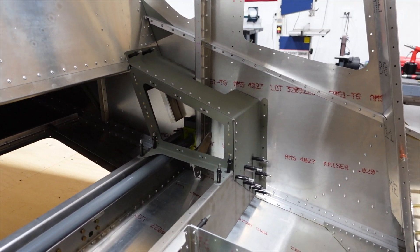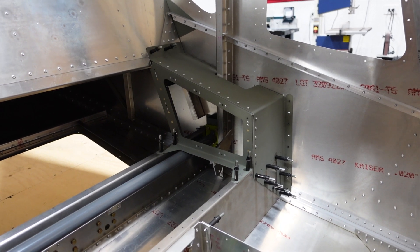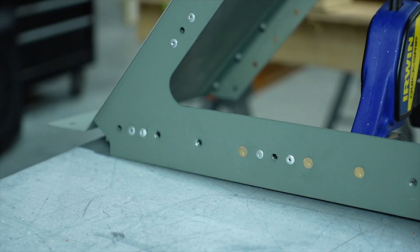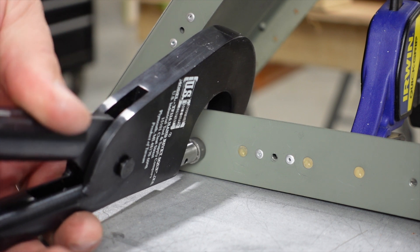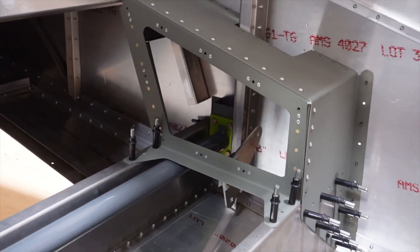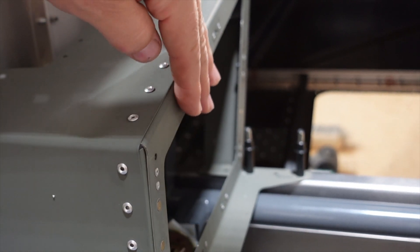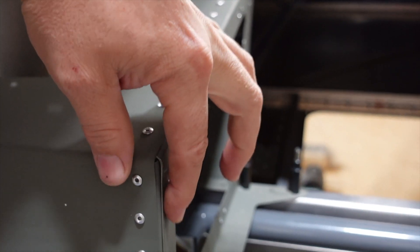One of the things I did is the manual said to use A5 flush rivets, which they didn't provide for the rivets around the frame there — you can kind of see the gold circles there. I went ahead and used my own flush rivets, did a countersunk hole, and put flush rivets there. You may ask why flush rivets when you've got regular pop rivets everywhere else — well, I'm not concerned about it. This isn't an aerodynamic place. And before I put these side covers on, I'll actually be putting a weather stripping tape, a small thin foam seal around that edge right there. That'll keep the rattling down, keep any excess wind from leaking through there, and it should make a nice tight seal. So I'm not too concerned with the small pop rivets sticking up around the nut plates. I just wanted a quick solution and I didn't want to use big A4 rivets in that spot.